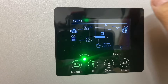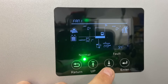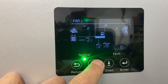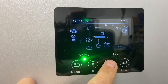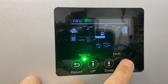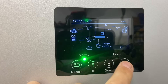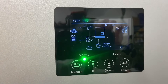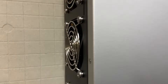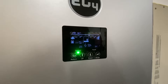Setting 24 is a fan setting. I actually have a mini split running on the unit right now so it's got a fairly good load on it. The fan settings are automatically at 70. I'll set it to 100 - it has a slope so it ramps up. If you disable the slope, there's fan 2 and we can set that at 100 also and disable the slope there. You can hear the fans ramp up - there are 3 fans. The unit's not going to let itself overheat, but you can adjust it.